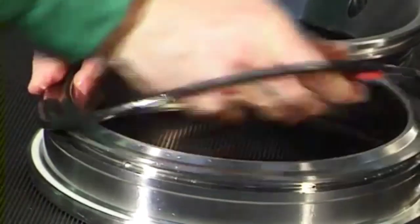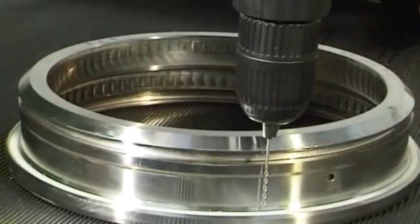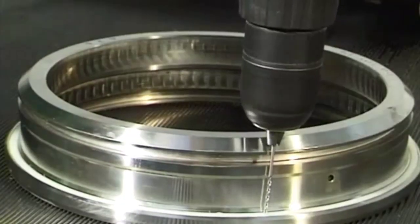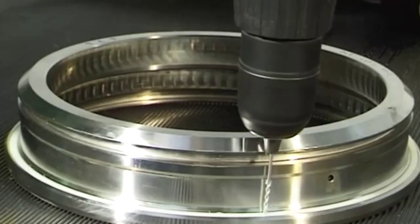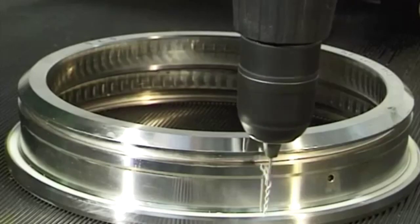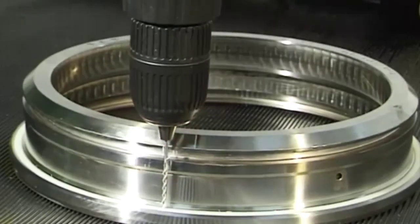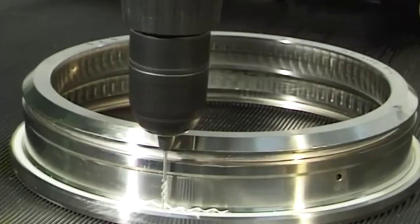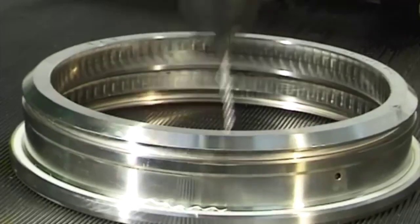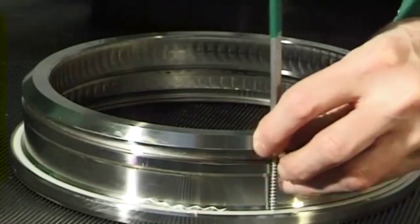Take the gasket out of the annular piston. Replace the polyamide gasket only when it is damaged. Drill two 2mm holes into the polyamide gasket. Use two screws to press the old polyamide gasket out of the guide and lever it out bit by bit with a screwdriver. Attention! The groove of the annular piston must not get damaged.